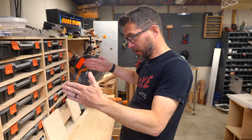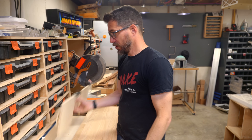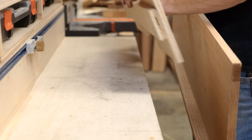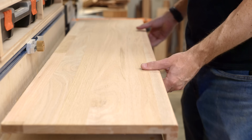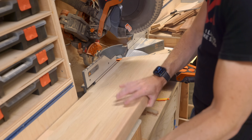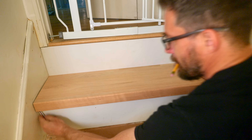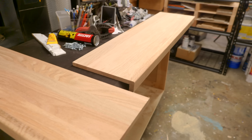I've got my measurements for the first step and I'm going to use the miter saw to cut the two angles on the sides. This step has a big gap underneath it, so I put together a couple pieces of material to act as a lift to support the back side so I can put it into the saw the exact same way it would sit on the stairs, and then cut the two sides to length. I got all the steps cut down to size, then did little bits of trimming and sanding to get them to fit nicely.